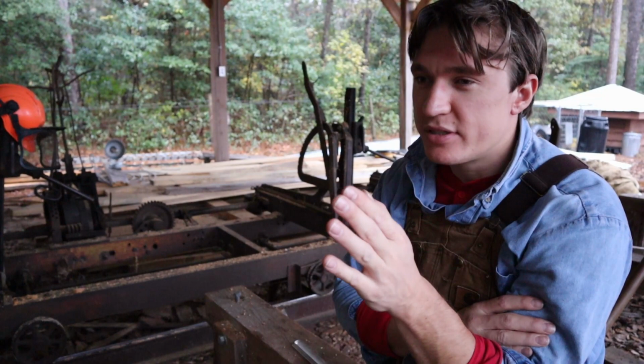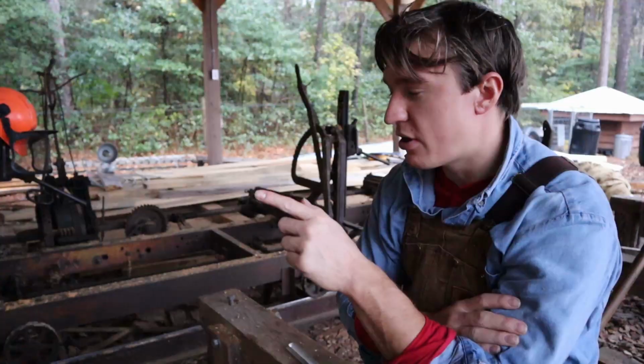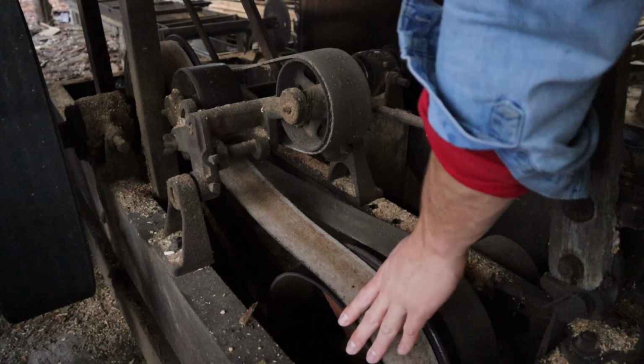So after you connect to the diesel engine, there's a main pulley called the PTO, power takeoff. You engage it, it turns the big 6V belt that turns the main mandrel, that turns the saw. And all your power is derived from that main mandrel. So you got a bunch of different belts hooked into it, in a couple different ways, so you can do a couple different things.